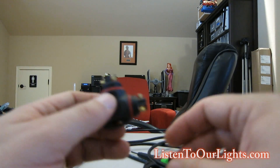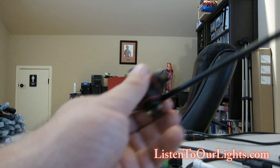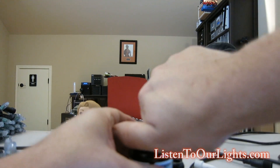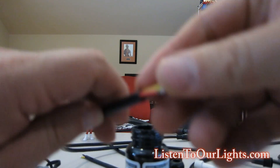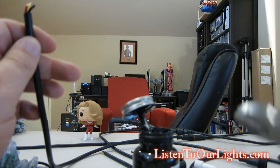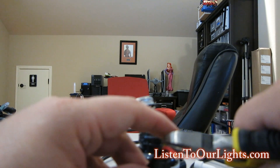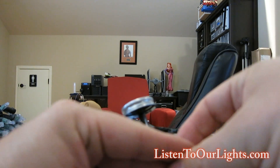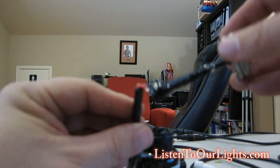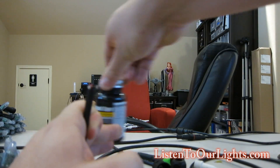So if I wanted to connect two types of things together, I just make sure I'm consistent with my positive and negative, and off I go. The one coming off the T will be for power — that one only needs the positive and negative, not data. I use three-core wire for my power injection because I have a ton of them, but really you only need two-core. So I snipped off the data cable and put a little liquid tape on it just to make sure nobody hits anything.